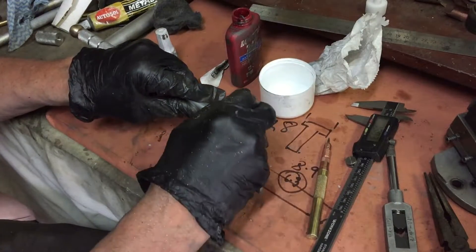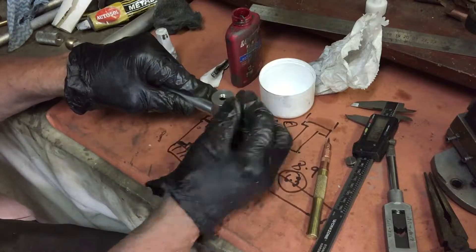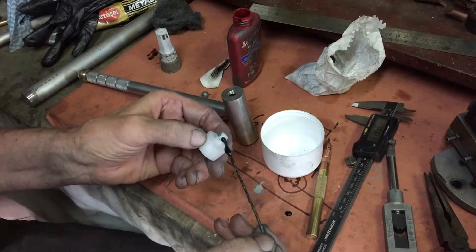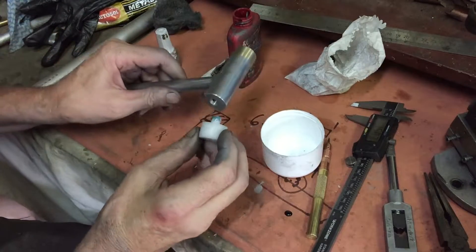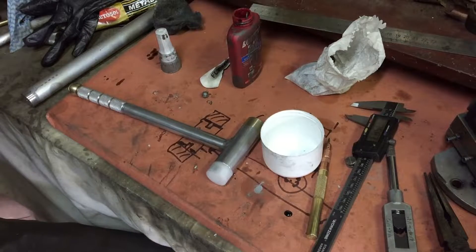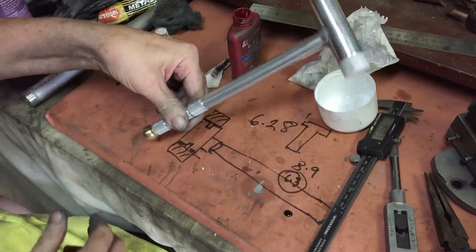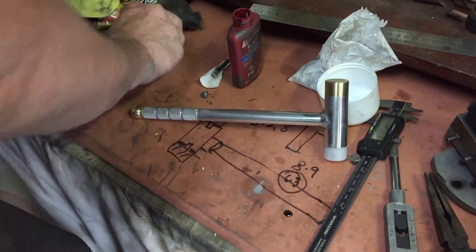We're all finished and ready for assembly. I've got the brass face on and now I can put all those little lead sinkers into the void. In case you haven't come across the concept before, a dead blow hammer is supposed to stop the hammer from bouncing. The moveable weight inside — in this case the lead — is supposed to damp it down and stop the hammer from bouncing back once it hits something hard. When you hit something hard with a normal hammer it will normally bounce back, which tends to make the struck object also bounce. This hammer is going to be used to seat pieces in the milling vice, so I want it to be nice and solid and not bounce around.